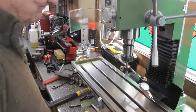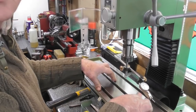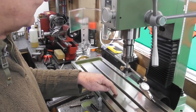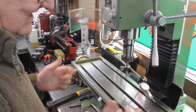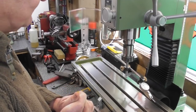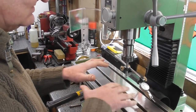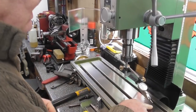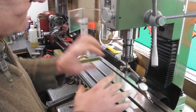My plan: normally when you're clocking up, a lot of people will use a brake disc. You can buy car brake discs fairly cheaply — they're pretty flat and circular, and you can clock around a brake disc which is quite a good idea. You can clamp it down in the center with a bolt and clock up the brake disc for truing up. I haven't got one — it may be something I'll keep my eye open for — but I'm sure I can manage without. So I'm going to bring the head down to near touch, touch on one side, and set a zero.